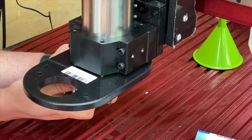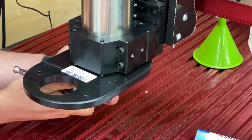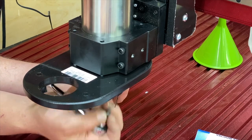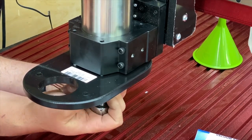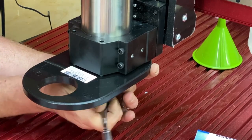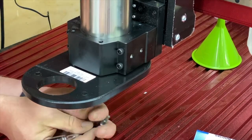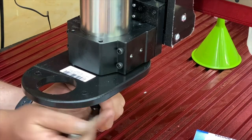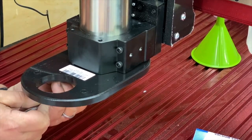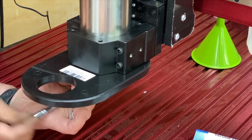That's the basic initial setup of the machine. At this point, turn it on, get your controller serial number and pendant serial number, go to NextWave's website, register your product, and when you put those two numbers in it will give you an unlock code. This is also when you'd add any dust boots or other accessories. One of the very first projects I'd recommend on any CNC machine is a spoilboard — it protects your bed from getting damaged if you accidentally go too far when cutting, and don't ask me how I know that.